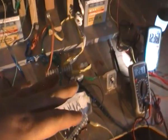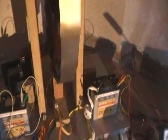You put the current onto an SSG circuit. This current goes to the coil. The coil produces an electromagnetic pole, opposite of the north pole. Remember, all of the magnets are north pole positioned. Each magnet is looking with the north pole to the coil. So what happens when two magnets see each other? They repel themselves. But then, for a short time, you have another pole which takes another magnet, and so on. This is how the wheel moves.